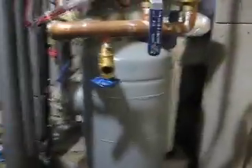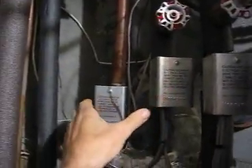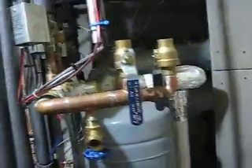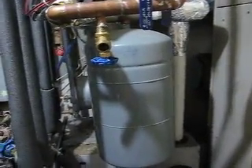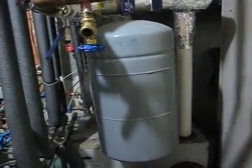Here's the boiler itself. I've expanded it — I've added actually two zones on it. These are the two zones I've added. I've also created more space for more zones possibly, but I haven't actually added them yet. And I've expanded the expansion tank because with so much zonage on here, it's good to have lots of expansion capacity for all that water when it gets warm.